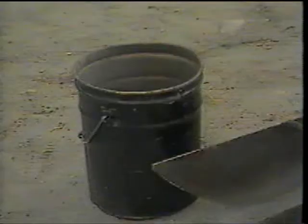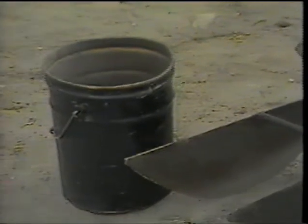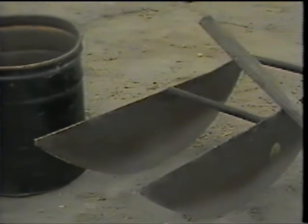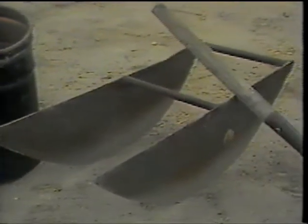Sometimes the belt must be stopped to take a sample. This is done to approve a mechanical device or when the plant does not have a mechanical device. To obtain an aggregate sample from a stopped belt, you'll need a sample container, a special template shaped to fit the conveyor belt, a shovel or scoop to remove most of the material, and a brush to remove the fines that the scoop cannot get.